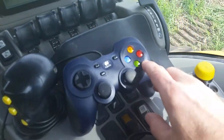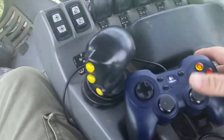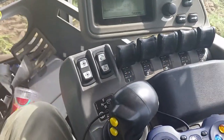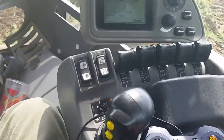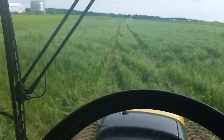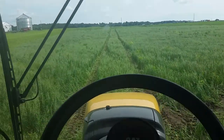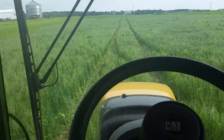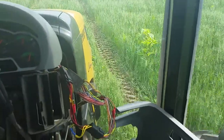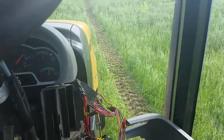The other thing I added, which I'm really excited about, is navigation. I just hit the wrong one — I'm at the other end of the field, so I had to hit the one to go south. You can see it's going to follow this line. It's the same code that I used in TractorBot 1 to drill beans, except I took out a lot of the corrections — it was so much simpler. And it tracks really well. There's a little bit of hunting, but it's amazingly good.